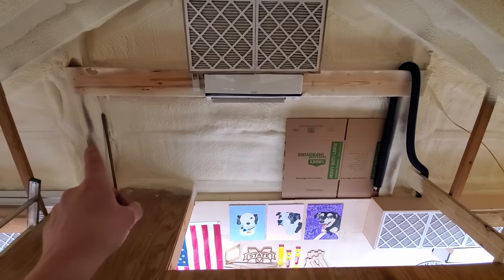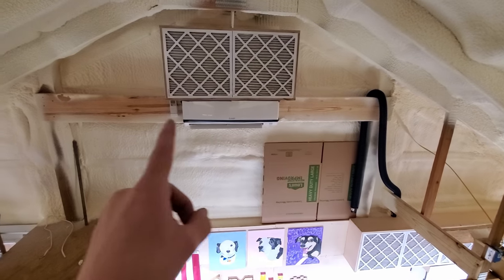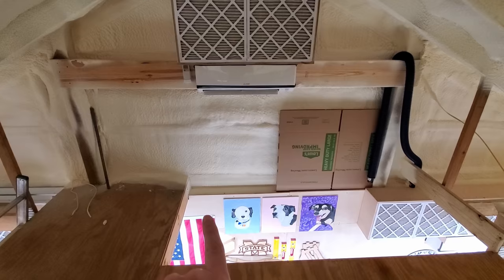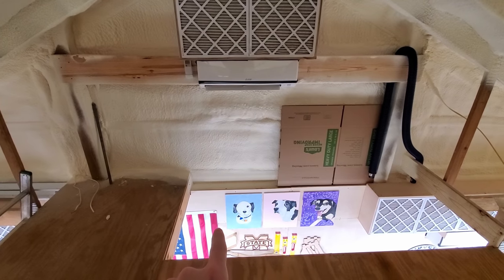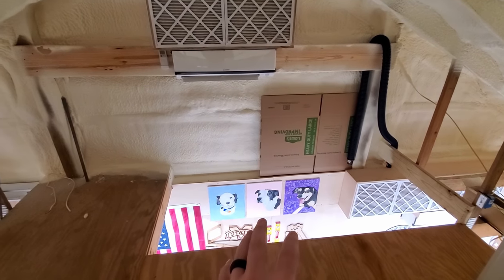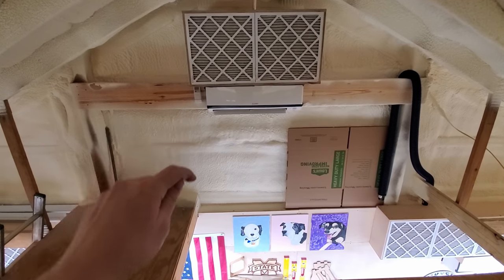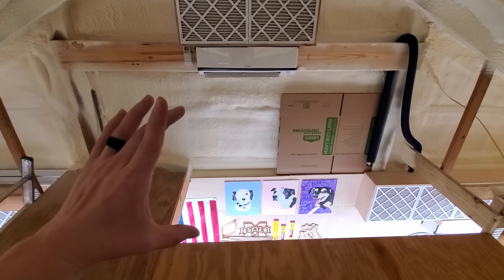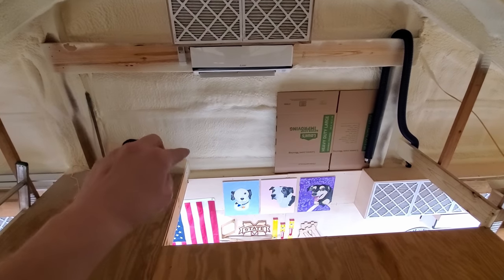Here's the view from upstairs. These are the two posts 10 feet apart. This is originally pole barn structure. This is a 2x10 spanning the distance, and that's what the mini split is mounted to. I'm going to put the leftmost super strut up against this side so that we have as little of a gap as possible between the platform and the elevator. There will be a little bit more of a gap over here, but I'm not too worried about it because that's not in the readily accessible area anyway. So the super strut will start here, mounted on the left side, and it's going to work its way down. I'll have to cut a short filler piece for the bottom side, and I want to do it that way so that the longest piece, the solid 10-foot piece, is going to span both the wall below as well as the structure I have to build behind it.